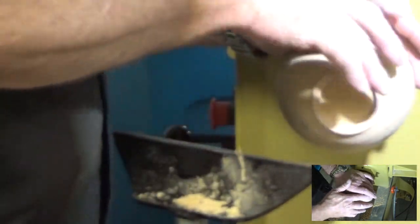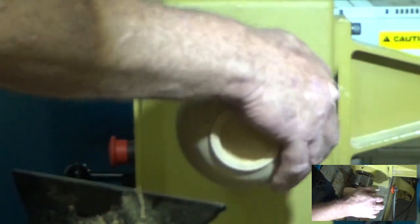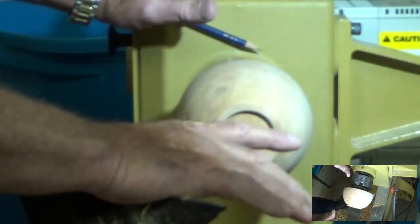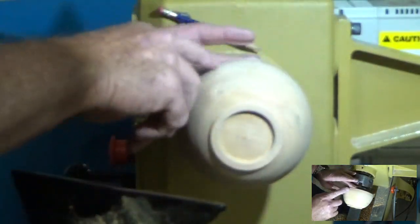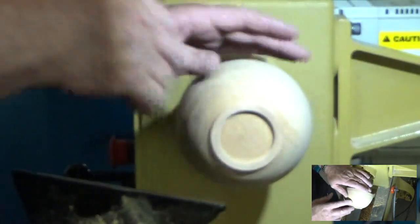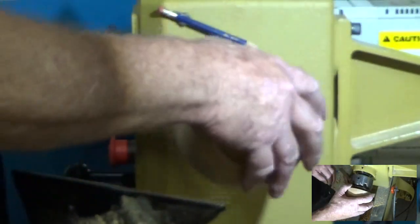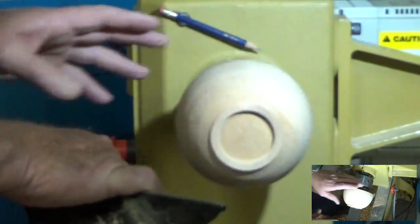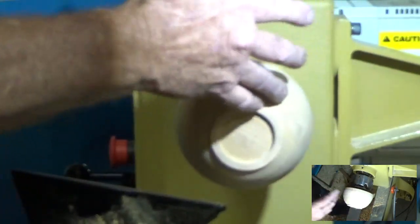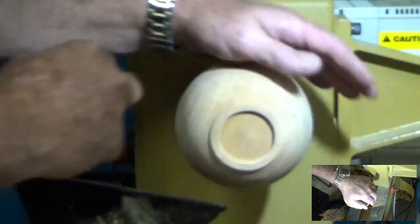But that's one thing, you can't sand too much, really. And the more you sand, the better product you're gonna turn out. And whatever sandpaper you start with, whether you start with 100 or 120 or 80, make sure you get every little defect, every little tear out, get it out with that first grit you use. Because, and I've done it myself, I think, well, I've almost got it out. It'll come out with the 120 or 320. It won't. It'll be there forever. So get them all out with that coarsest grit. All you're doing with the other grits is taking out the scratches from the previous grit. That's all they're to do, just smooth things out.